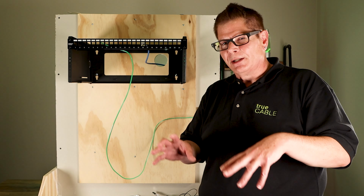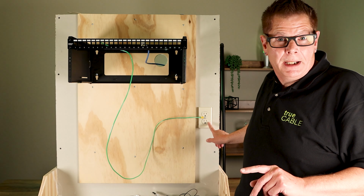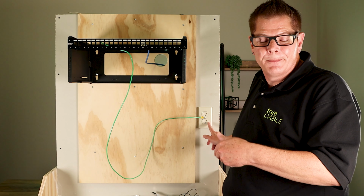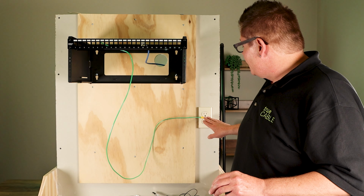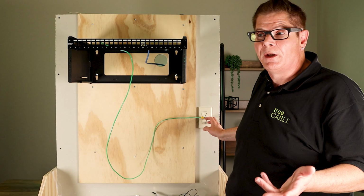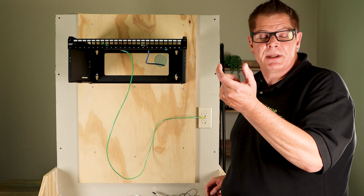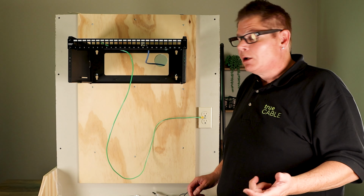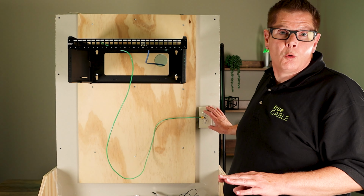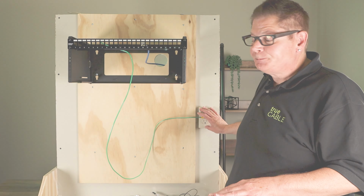I'm going to digress a little bit. Make sure that your three-prong outlet, which you assume is correctly wired and actually running to ground properly, is in fact wired up properly. Head to your nearest hardware store if you don't have one on hand. It's a three-prong outlet tester, and it lights up telling you whether the wiring on the outlet is correct or not. Make sure this is right before you count on this method, because it does require a properly wired outlet.